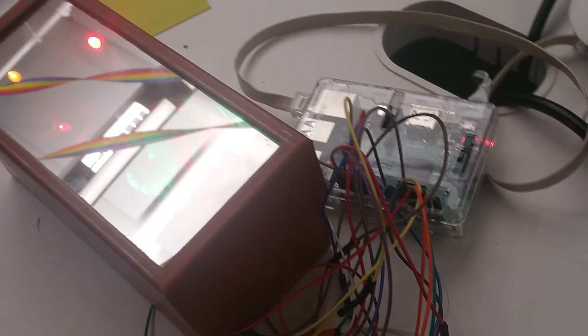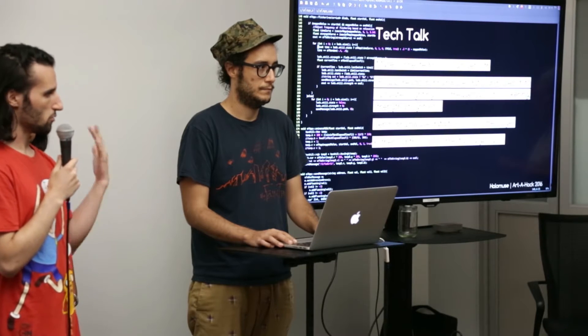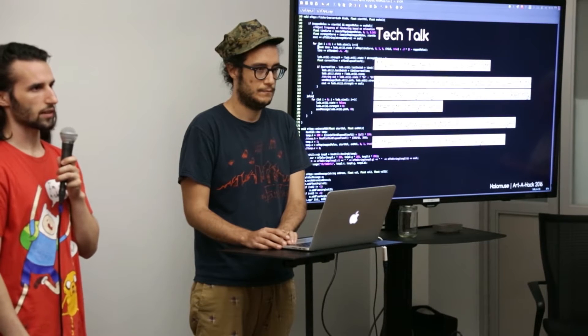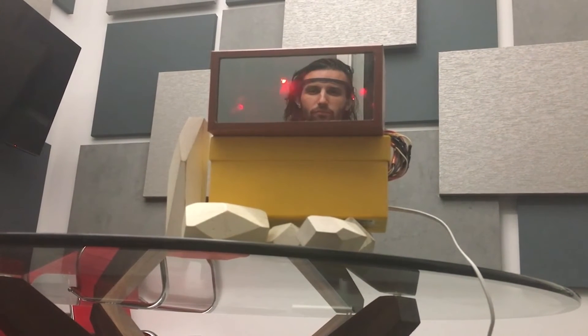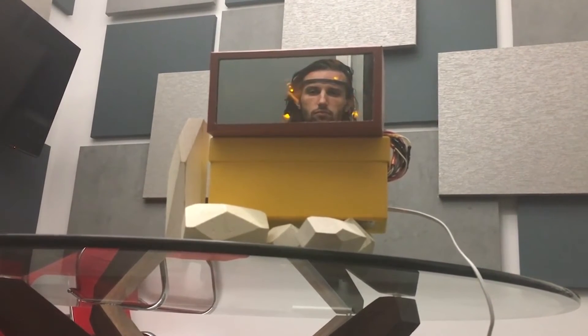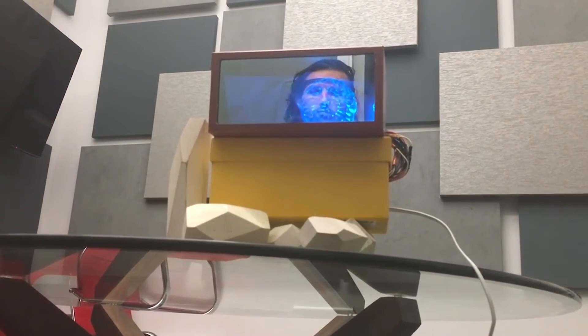The way it works is we took the Muse, which outputs a range of brainwaves across five different frequency ranges: alpha, beta, gamma, theta, and delta. We wanted to explore what it would be like to visualize somebody achieving a state of focused relaxation — not just as a digital display, but as a more physical realization. We brought it into a custom OpenFrameworks application and piped it out to the Raspberry Pi, where we made the LEDs flicker into red, bright, passionate colors when you're not focused, then slowly mellow out through the rainbow spectrum to a soft, stable blue when you are relaxed.